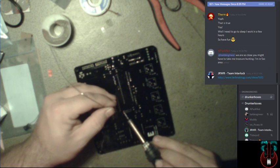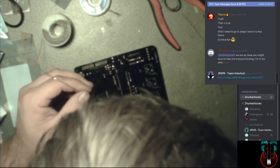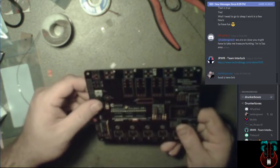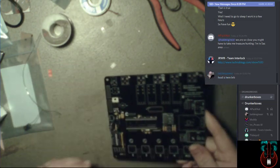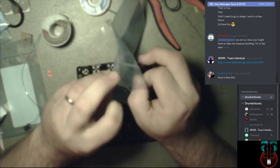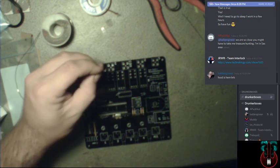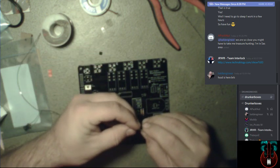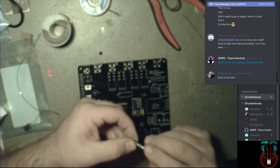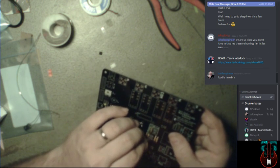Also, it says here that it looks like a PWM frequency of about 61 hertz at 1 megahertz on the ATtiny85. So 61 hertz isn't that bad. Since it's so memory limited to begin with, I think they only have 8K of programmable ROM. Because I'm just making a cheap hardware badge.